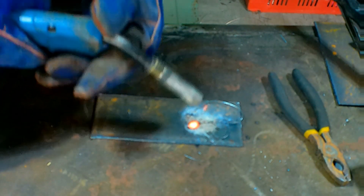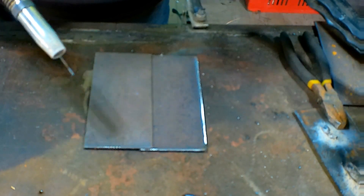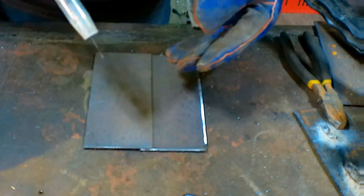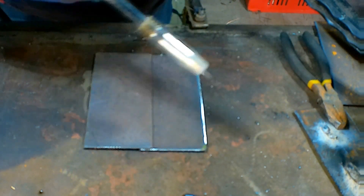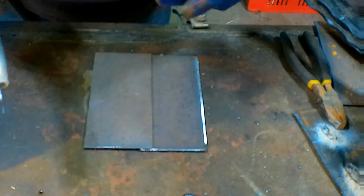And it's better. See that? It doesn't jump around all over the place, because the wire is now getting consumed into the weld puddle. That wire speed is surprisingly easy to do. You only have to do it two or three times and you'll feel in the gun whether it's behaving like it should. If it's pushing you back, you've got way too much wire or you haven't got enough power. Just put a nice balance there - it only took me one attempt. It's not perfect, but it's perfect enough to weld.